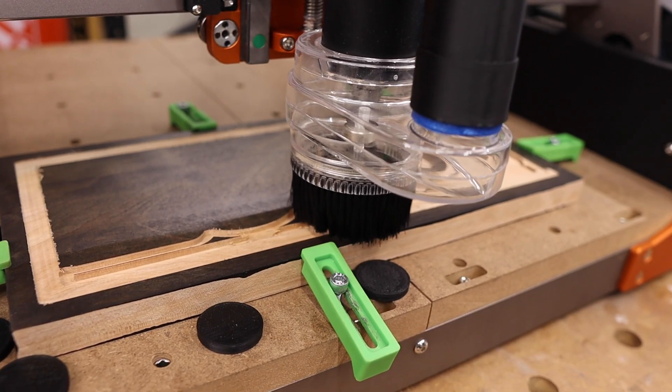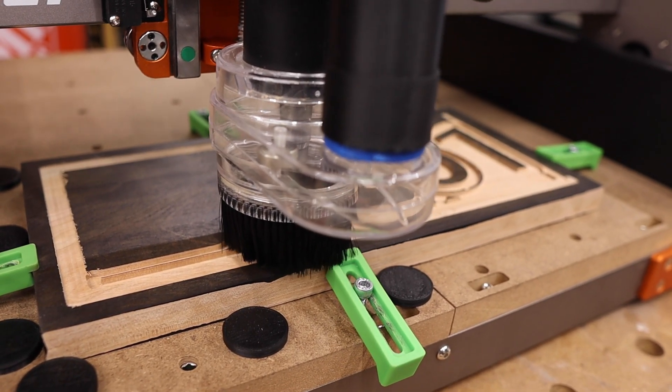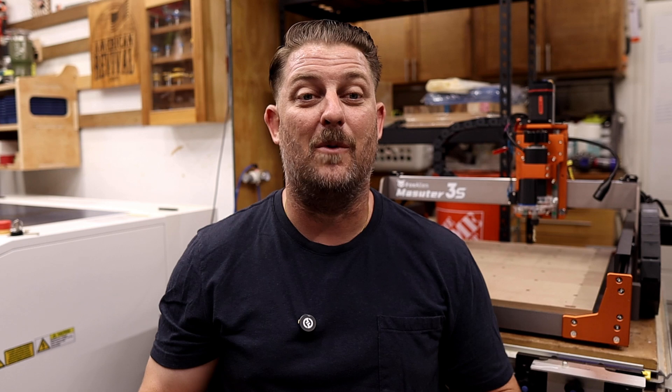I was also really impressed that it handled a quarter inch end mill. When using the quarter inch bit, I did have to lower the feed rate and depth of cut a little bit, but the end result was really nice. I'm glad because I really wanted to use the spindle — they're so much quieter than trim routers and you can adjust the RPM as well as turn it on and off through the G-code. It's great though that Fox Alien also includes a 65 millimeter mount for a trim router. This lets you run any 65 millimeter router like the Makita version, and Fox Alien also sells a pretty nice little trim router as well. Although they are louder and aren't controlled by G-code, they do offer more power versus the 400 watt spindle.